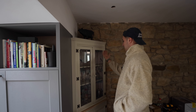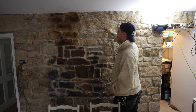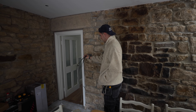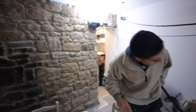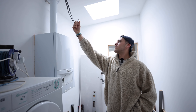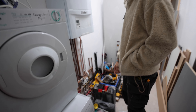I've got feeds behind there to put LED tapes inside here. This wall was completely covered by kitchen units and you can see all the holes, so I think we'll do our little trick tomorrow to get rid of those. We've got this chased into the sandstone for all our light switches. Got the utility room consumer units in there — I think I'll let Dan do that tomorrow. And this is going to be a cupboard across here, so we've got a smoke alarm or carbon monoxide alarm in there, plus a few spurs. I really need to do their heating controls as well.